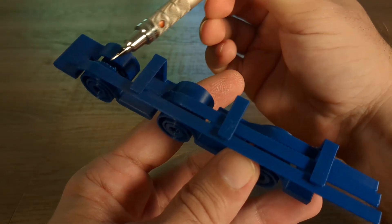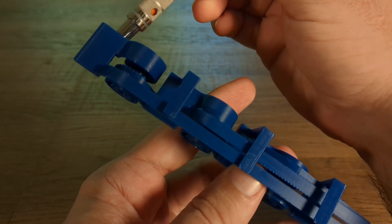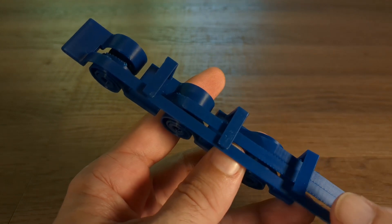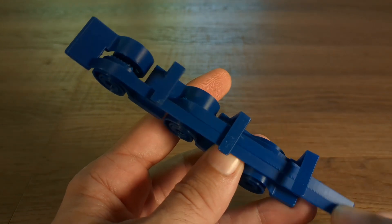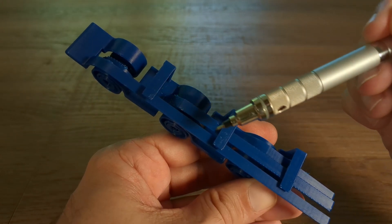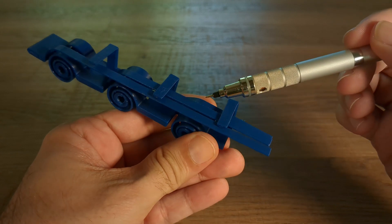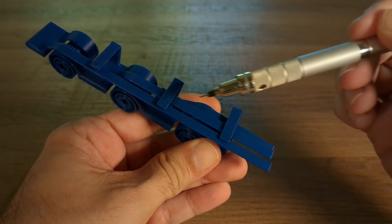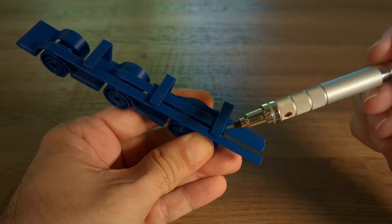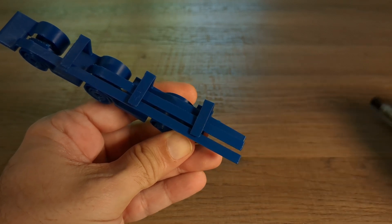For the future, there's a lot to improve on Fingy. The tendon should apply symmetric force — for example, the tip of the finger should have the tendon in the middle instead of where it currently is, as the current tendon bends the tip to the side. The second segment should have a symmetrical Y-shaped tendon that wraps around the middle tendon, and the final part should have a tendon that wraps around the other two. Fixing these tendons will make Fingy's movement far more centered. Additionally, the tendons need connection points for the motors — but that's all for version two.